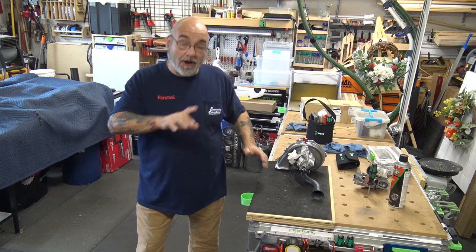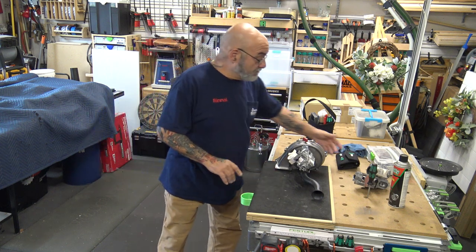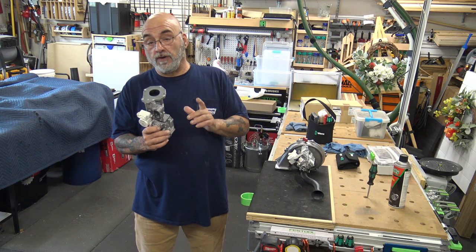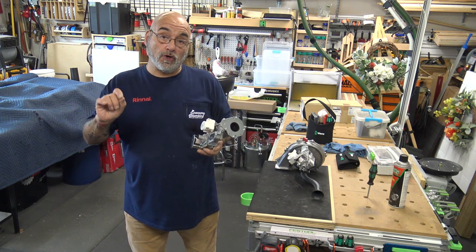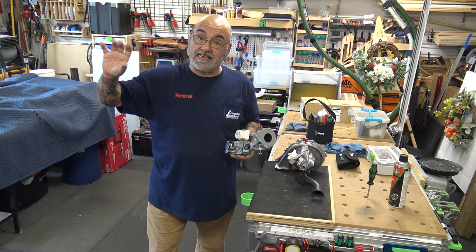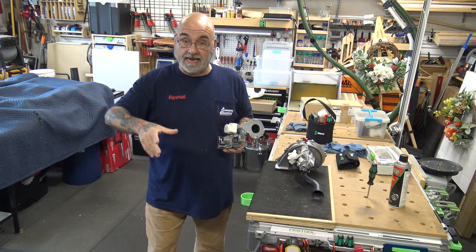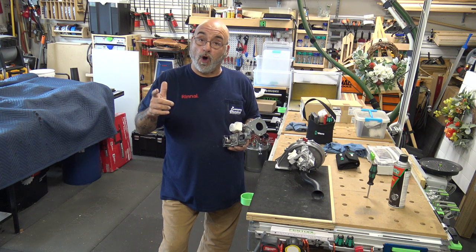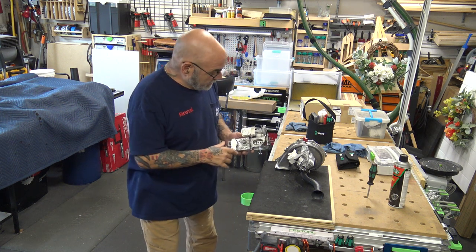All right, today's video is actually going to be on a code 15, which means that the Venturi gas valve has malfunctioned on a Rinnai unit. Now, the unit that you're going to find this gas valve on is either going to be an RU, an RUR, or a CU, or also the CHS 199 demand duo that has a CU on the front of the 119 or 80 gallon tank. You're not going to find these on a V, an RL, or the older RU, RUR units that are not the Sensei.